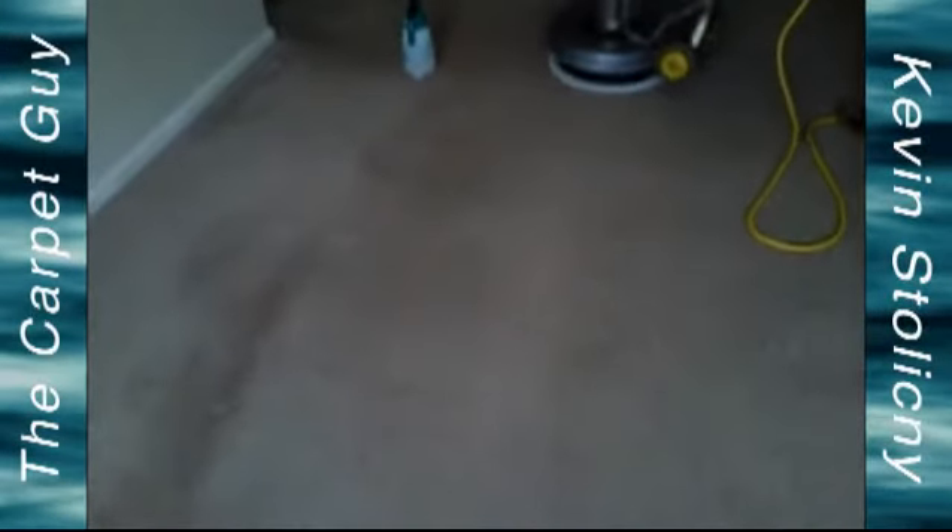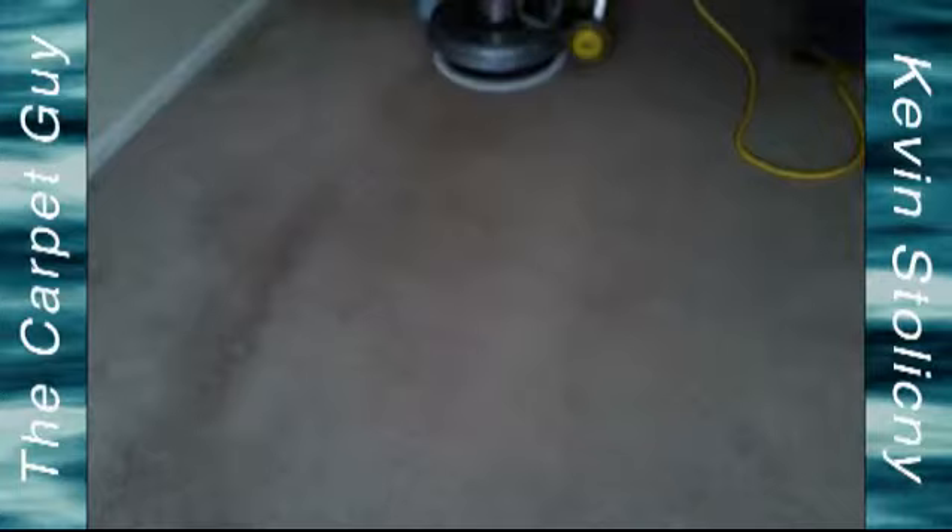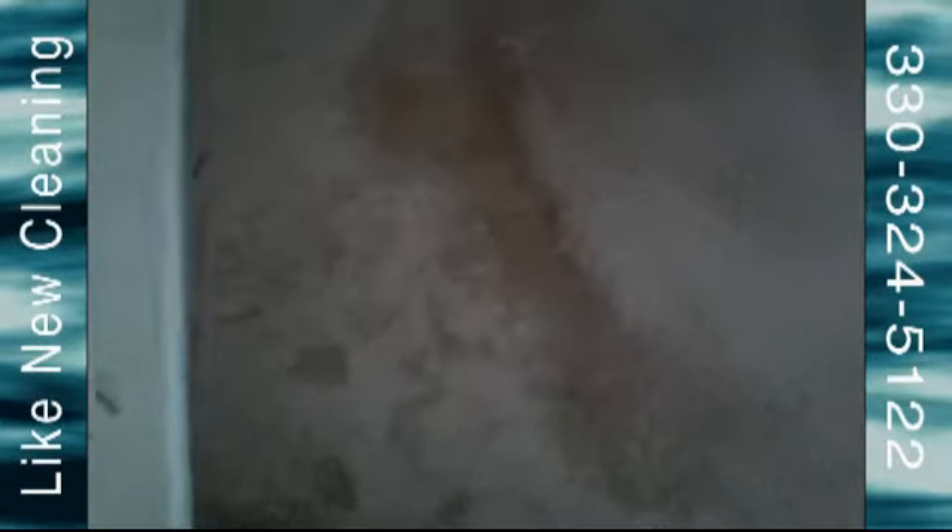Hey, it's the carpet guy again. Does this place look familiar? This is the dreaded apartment with the dreaded polyester carpet. We are doing our final finale on this one. This time we will just be bonnet cleaning. We're using some encapsulation juice, which basically means the product is specifically designed so that once it dries, whatever soil is left remaining in the fiber — when the product dries, it actually encapsulates or attracts the soil to itself. So there you can pretty much see this is our final step. This spot over here is where the couch was, and you can see that spot right there in the middle — that's just where the carpet's bent over from the direction the bonnet machine's hitting it. A lot of times with these polys, you'll run into that. There'll be some residual soil left over, but overall, I'm pretty sure we've saved this one.